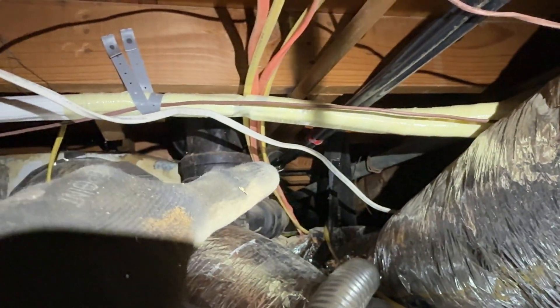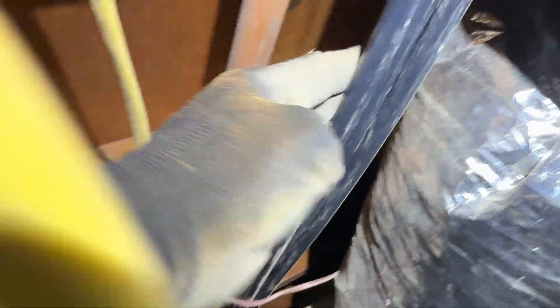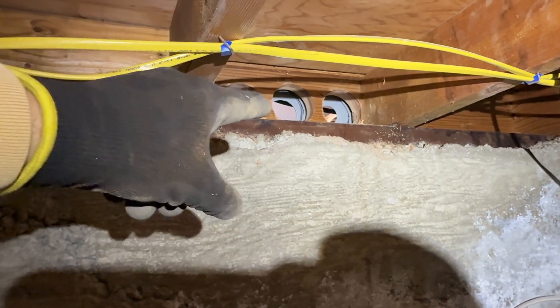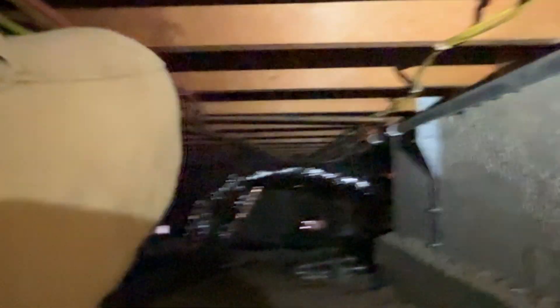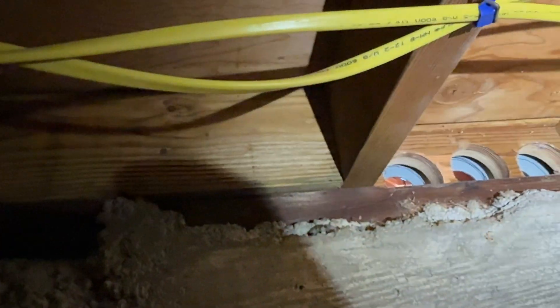Right there is a two-inch conduit — we did remove part of it, so now we just have bare wires. Those wires are going to go in a flexible conduit and go to the gutter box right there, and then to the Solark load side. On the other side of the two-inch conduit that we cut, we're going to install a junction box there, use insulated lug kits, extend those cables, and run them here as well to the Solark grid side.